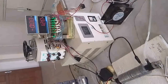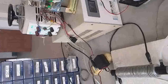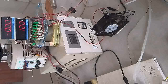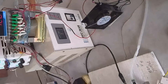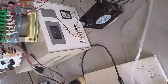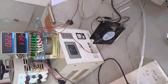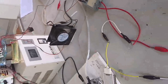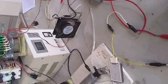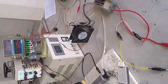The transformer stops working immediately. You can see on the ammeter that when the short circuit situation occurs, the current is zero. To reset, disconnect all the input and output wires, then reconnect them, and you can see on the ammeter that the transformer is working again.